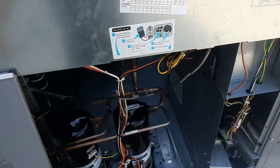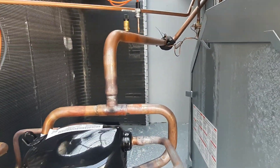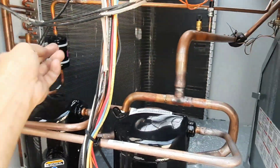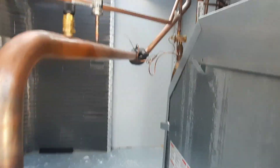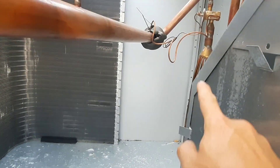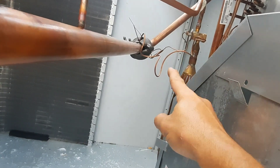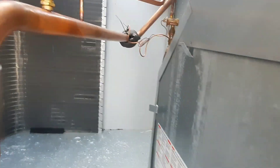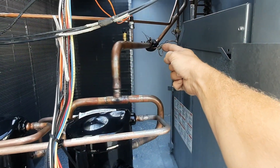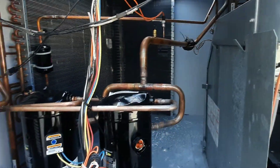This is a Carrier, so I'm gonna bet I got a cap tube rubbing somewhere. Carrier's gotta have a cap tube — be secured back there, it's rubbing on itself, just being pulled up like that. Usually it's right here, or it's just almost touching the suction line, unless somebody pulled it off. All right, let's take the control panel off.